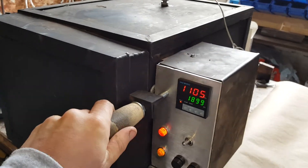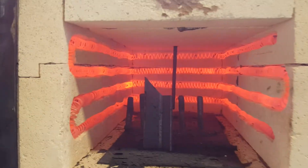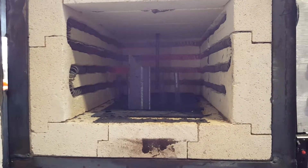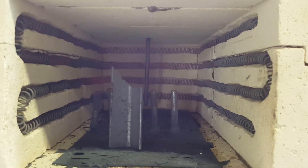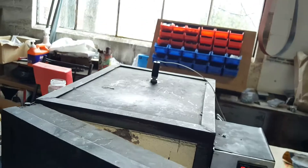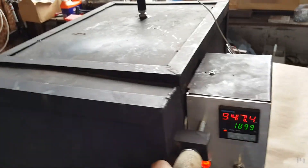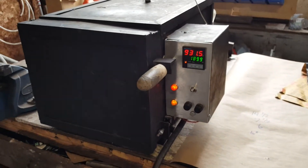I'll open it up and let you have a look inside — it's only at 1,100 degrees right now so it's not too hot yet. That's just a piece of angle iron sitting in there. You can see the fire bricks — I kind of routered everything to fit together, and did the same on the door as well to retain as much heat as possible. This is a single element — I didn't run multiple elements in parallel or series. It's about 57 feet of Kanthal wire to achieve the wattage I was aiming for. There's also a second solid state relay, which is required to ensure power doesn't go through the coils inadvertently.